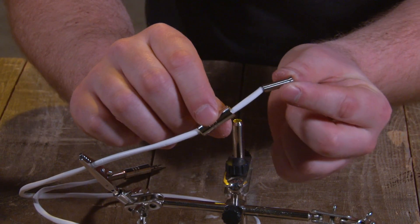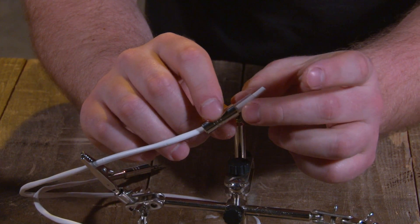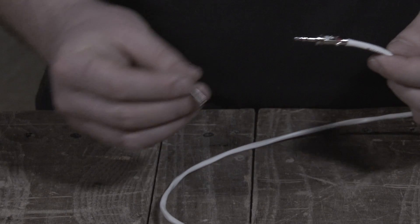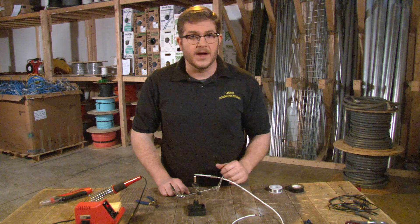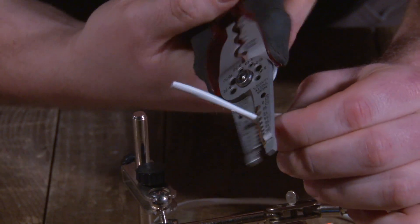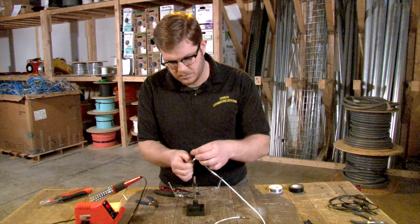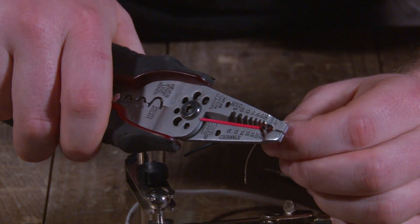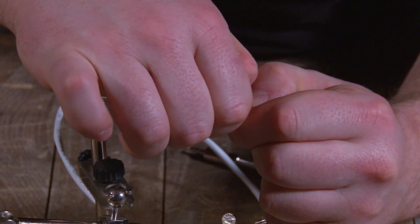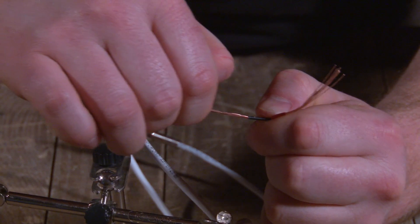Immediately slide on the screw-on cover over the cable. It is much easier to do this now before you strip the cables, because you will not have frayed wires catching and there's no putting this piece on after you've soldered the connector. Strip the outside jacket back two inches. Remove any metal shielding. Trim any strings you find as well. Strip each inner cable back about one quarter inch in front of the jacket. Don't worry about the length yet — we're going to cut them down later.